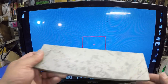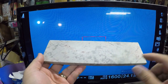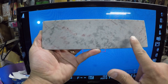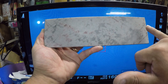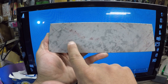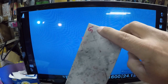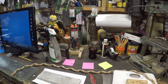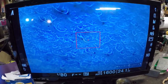This stone is 10 inches long by 3 inches wide and only a half inch thick. This side has no markings — it also didn't come flat. The only flat part is in the middle. I left the edges a little low thinking that as I use the middle it will come down until it meets the edges and we'll be all nice and flat. The other side has a G written on it in marker — that's the side we're going to glaze. But first let's look at this side under the microscope. I had it lapped to a 220-grit finish.